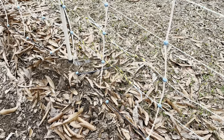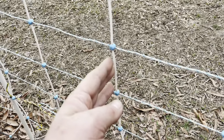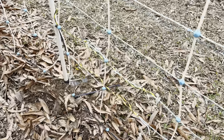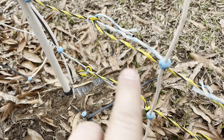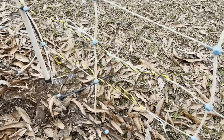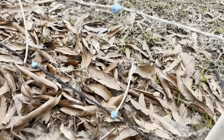So I want to show you this — this is a repair. This particular one from Starkline is their sheep and goat netting. The difference is it has plastic uprights between everything, so the horizontals are hot and these just help the fence stand up better. We really liked this one when we got it because it stood up a little better than the one that's just all wire. But what happened right here was that at this joint the wire broke, and then on this side it broke over here, and then the same thing down there. What we did was tie it back together with some single strand wire so that it would have continuity — meaning the wire will conduct electricity all the way across. Even down here, see how that upright broke right there.